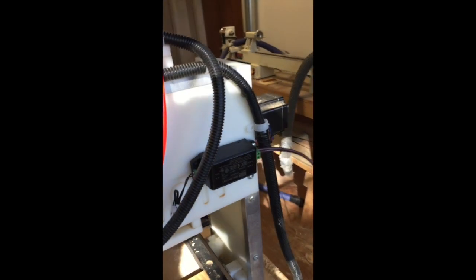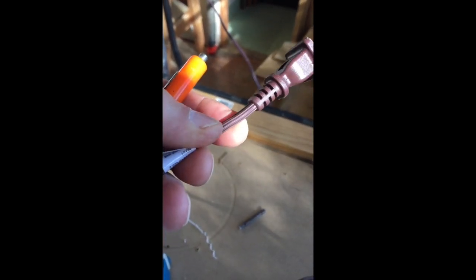I'm connecting the power supply to a six-foot extension cord — it was cheaper to buy the extension cord at Lowe's, a Christmas special for $3.69. The wide spade is your neutral line and the skinny one is your hot line. You can see the wide or thick flange is connected — the cord has small serrations along one side, the hot side is smooth, and the neutral side is serrated.